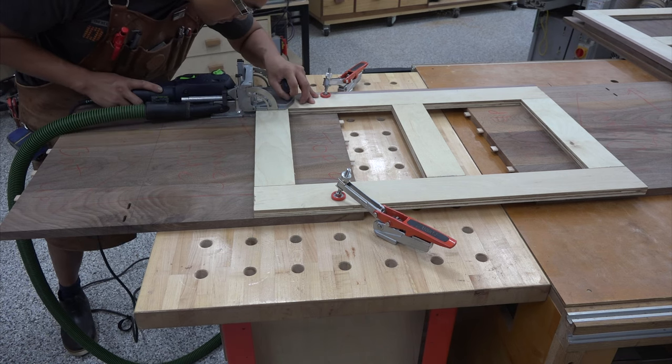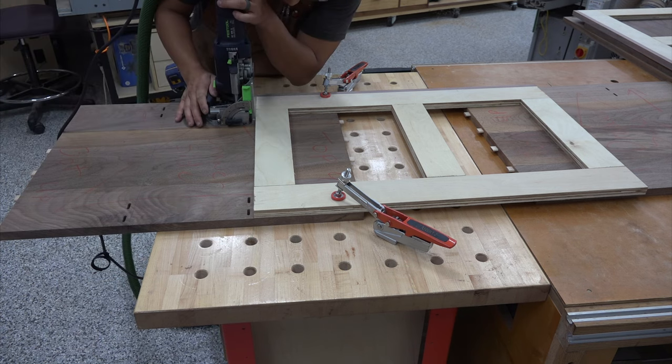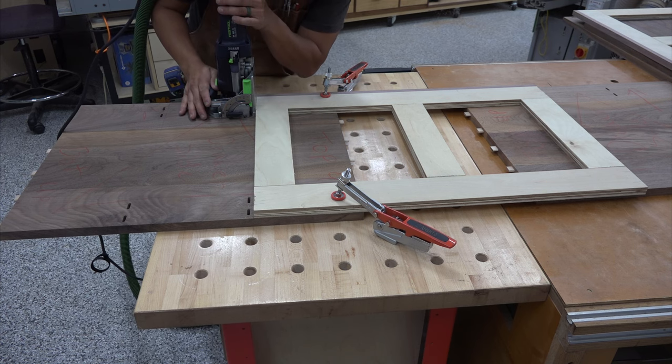To allow for expansion and contraction of the solid walnut carcass independent of the drawer dividers, I purposely undersized the stiles and made sure not to apply any glue along the back rail. The dominoes properly aligned the back rail along its width while still allowing it to move forward and back along the length of the domino. Therefore the front and back of the drawer dividers are rigidly constrained to the vertical dividers, while the undersizing of the stiles allows for the front and back to move in conjunction with the rest of the carcass.